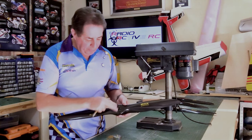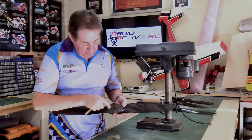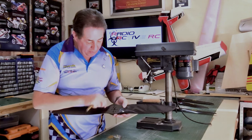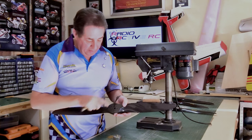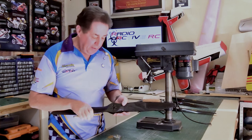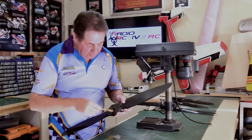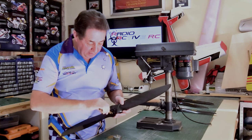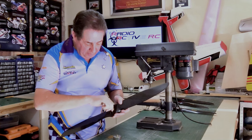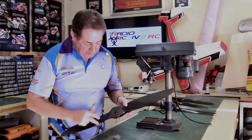There we have it — all drilled, all nice and neat. You can see by using the timber at the back, as the bolts come through we haven't burst away anywhere because we started from both sides. We eliminate a lot of that — the bolts will drop through nice and cleanly now and line up with your prop hub. I like to clean these off just a little bit — you don't need to do this, it's just something I like to do. Just give it a bigger drill bit in your hand, slightly turn it and just take off the edges so you get no dags and no burrs hanging around, nothing's going to catch your hand. And essentially that's it.